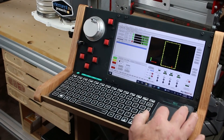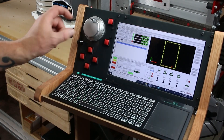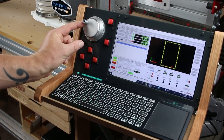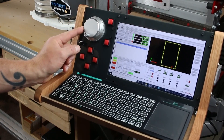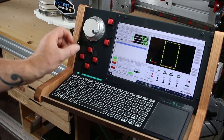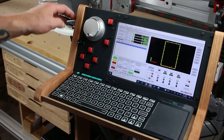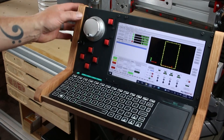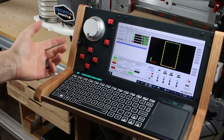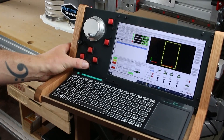On the encoder I can change the incremental jog step — it's set for a hundredth of an inch and it is in the X position. It moves the cut head ever so slightly unless I keep going with it. I can change that to Y, and finally Z. We also have the arming switch here on the side. It's got a red LED, which means it is not safe — red means armed. Flip that up, the LED changes to blue and it's safe. None of the controls work anymore. Flip it back on and we've got jog movement again.